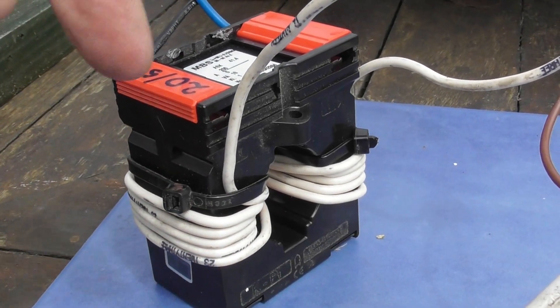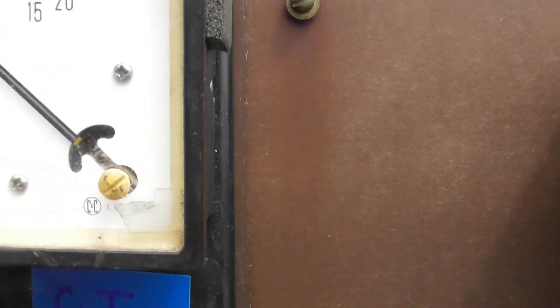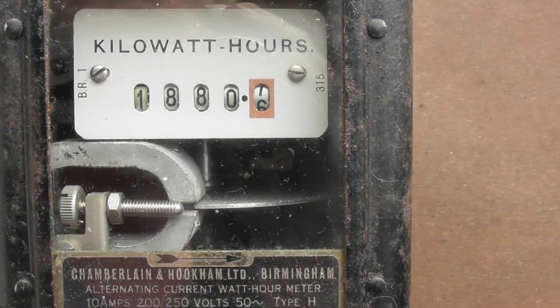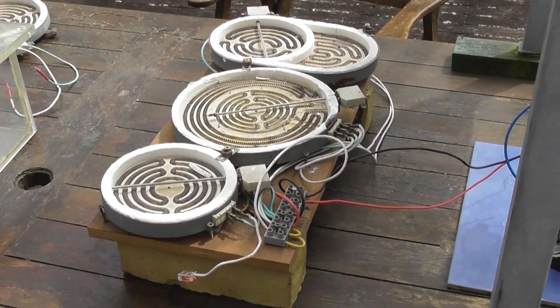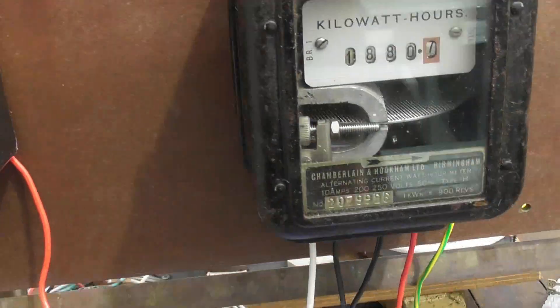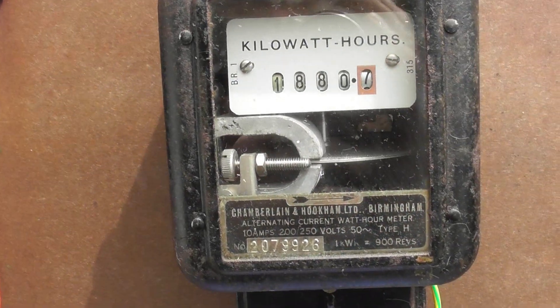All the same way, makes it a 20 to 5 CT which matches exactly this meter. This meter is happy — it's within the current range. A couple of my test loads in here; I've disabled some of the devices to reduce the current. I want to keep it in a reasonable range for these two meters. This is a metal case meter.